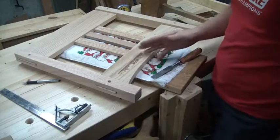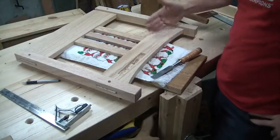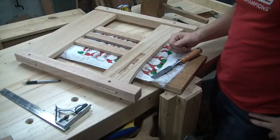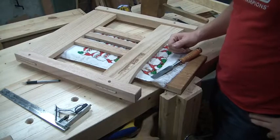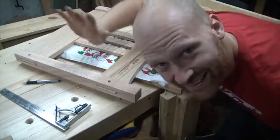So it's just a slow process of working from one end to the other. Then put the board in there, make the line, and trim out that groove to fit. And there you go — that's how I'm making a long mortise. I hope you like that. Tell me what you think in the comments, and I'll see you next time. Have a good day.